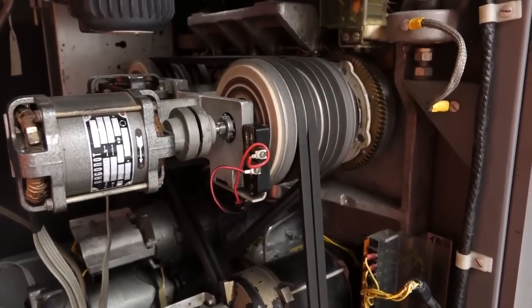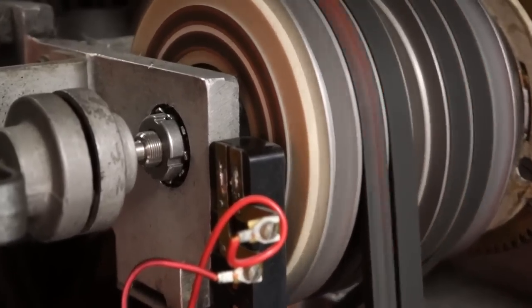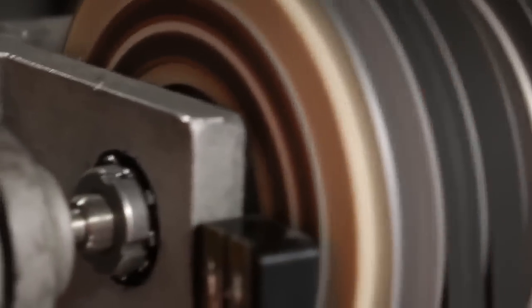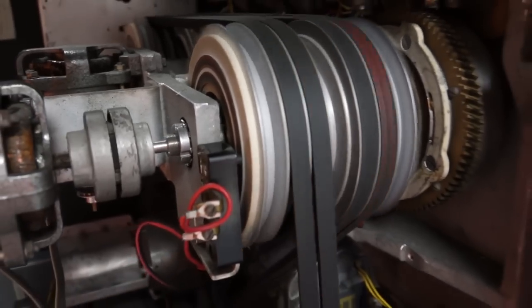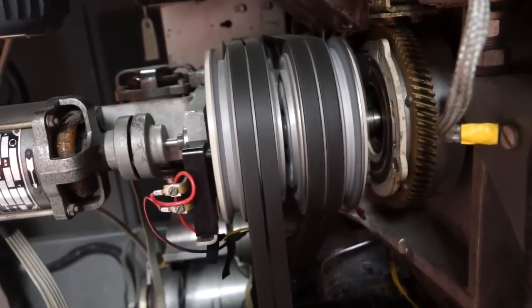And our specific problem here is with the way those clutches are actuated. Since they are rotating, you need a slip ring to provide a current. And those are those two copper rings. And right on them, you have a block of brushes that provides a current. And those, of course, with time, spent riding on these copper traces, are failing, and we need to replace them.